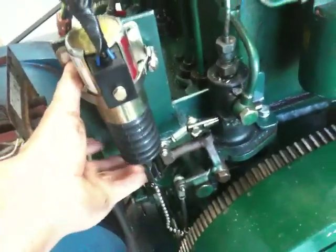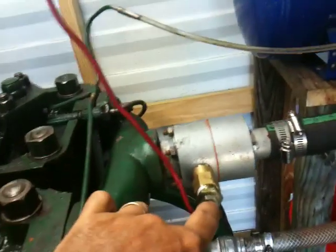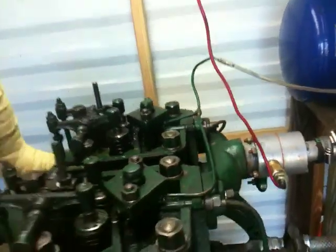He used the same Murphy system here for a solenoid for pulling the rack to shut it off. Right up here is the Murphy gauge, which goes to the Murphy relay control box, and of course the coolant temperature is sensed right here as it comes out of the cylinder head. So we'll start it up, let it run and I'll shut it down.